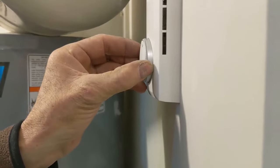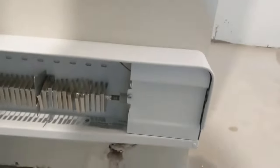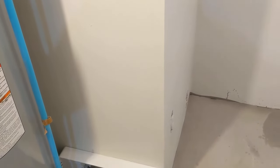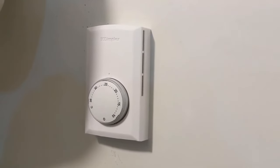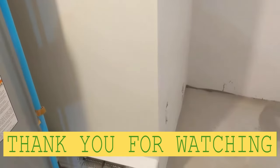Just to test it, let's put it a little bit higher. This thermostat is just kind of underneath the stairs — I just want to keep it warm. It's a storage space and I'm trying to make it like a living space, just to have a bed and stuff. My shower is there so I just need some heat. My heater is working! It's on a 15 amp breaker for the heaters and working great, didn't see any problems so far. I like this double pole thermostat more than the single pole — it works pretty good. I love you guys, see you on the next one.